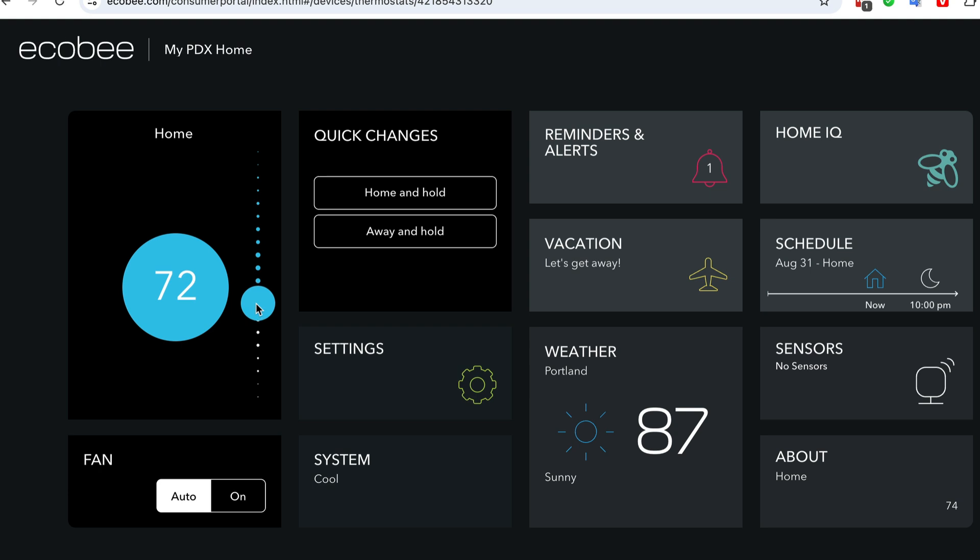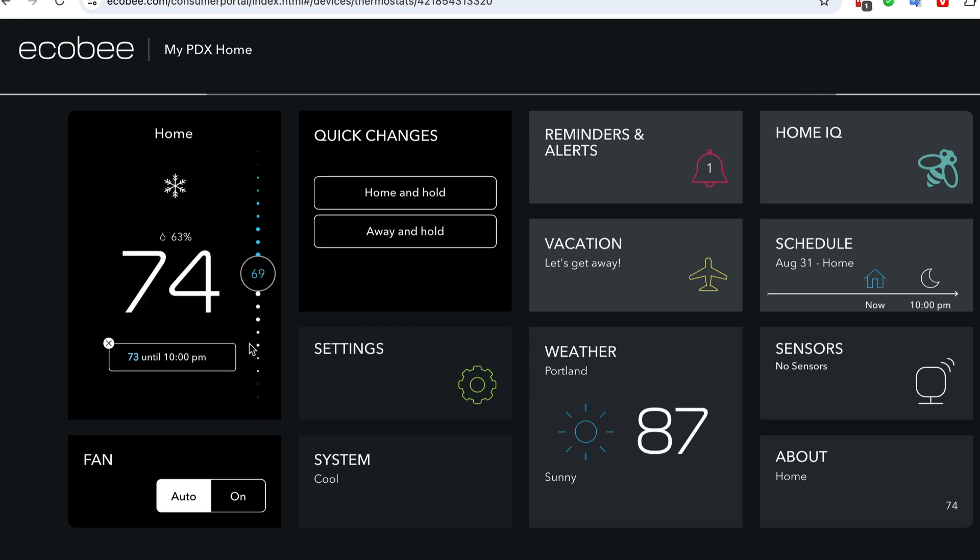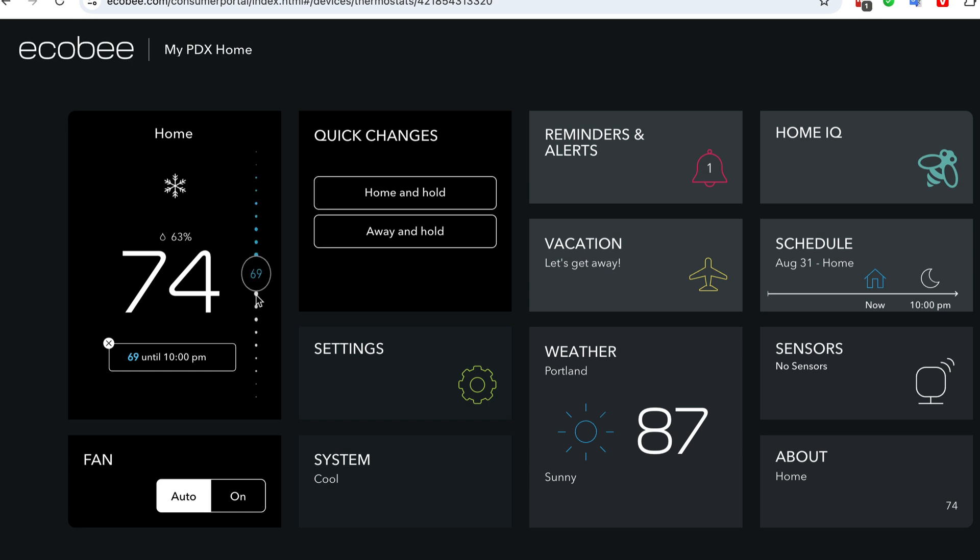And now we're going to use it here to change things. I just heard it kick in — so there we have it. We are currently pre-cooling my house; you can see it's down to 69 degrees. As other people start coming home from work and turning on their ACs, I can turn mine off and let mine coast for the rest of the night. That way it takes the peak demand off the grid.